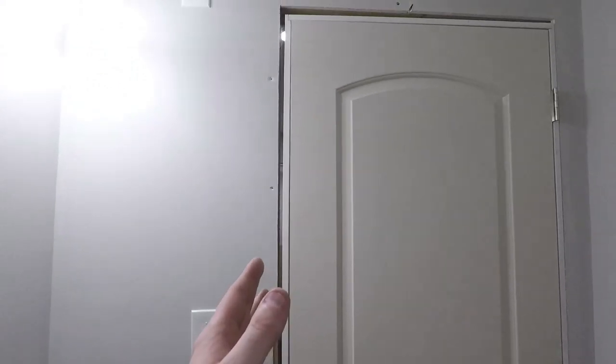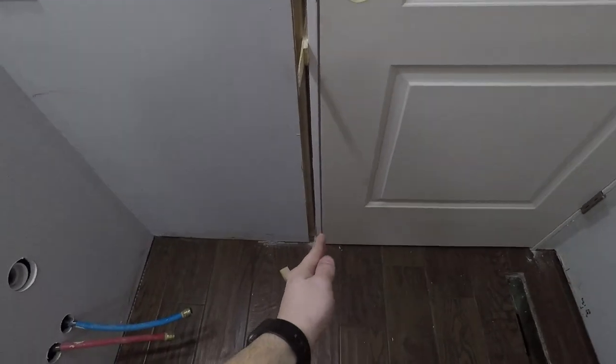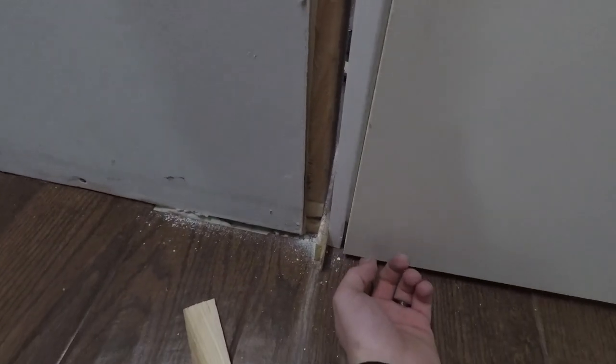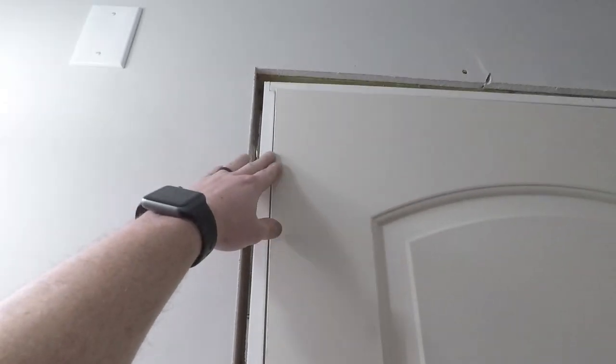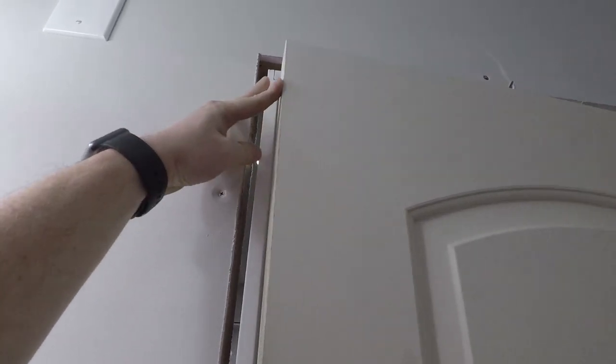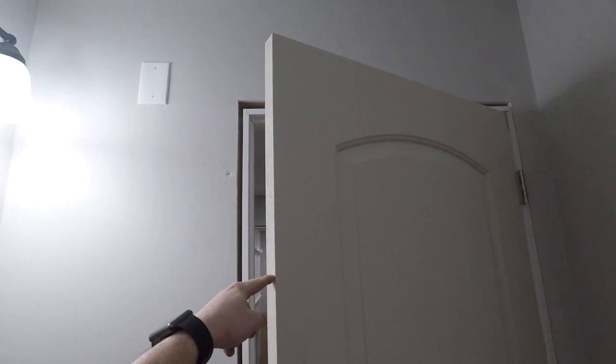This particular door is probably the sixth or seventh one I've installed and I've never found one that had a good gap at the top. So what I do is set the bottom with a decent gap where you can open the door and it doesn't rub, then match that gap in the middle, and at the top just leave it how it is. I generally have to take a plane and shave off maybe an eighth of an inch off the top of the door, because right now it doesn't rub but after painting it will. So I'll screw this one in and then take about an eighth inch off the top 18 inches of the door.